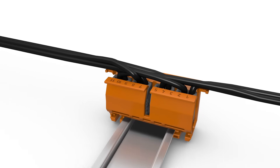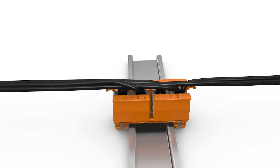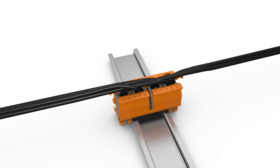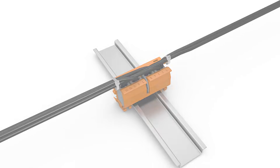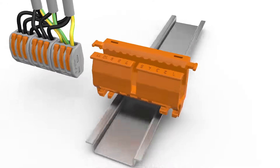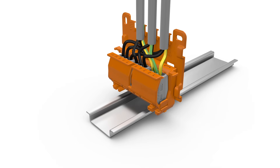For instance, in distribution boxes, when used with mounting carriers on a carrier rail, cable strain relief can be implemented by adding cable ties at the mounting carrier perpendicular to the terminal block direction. The snap-on strain relief plate enables securing of round cables using cable ties.